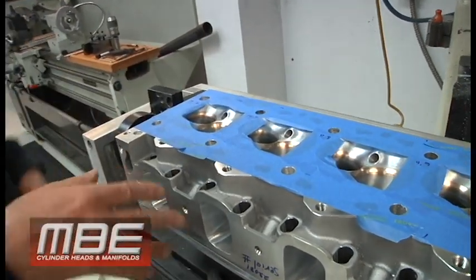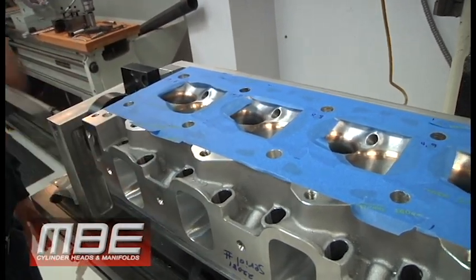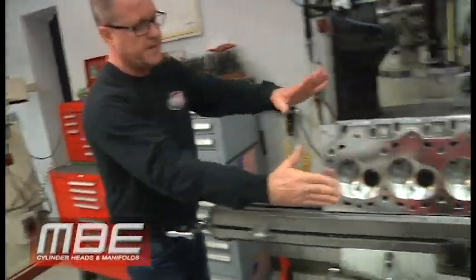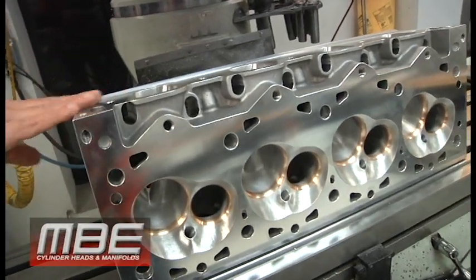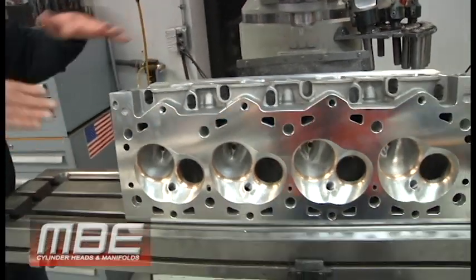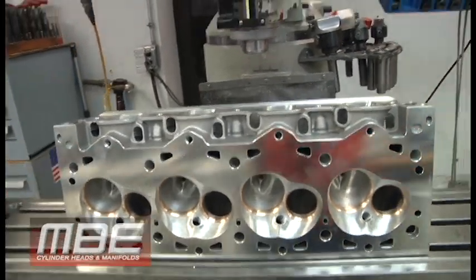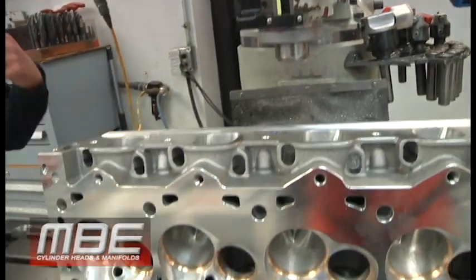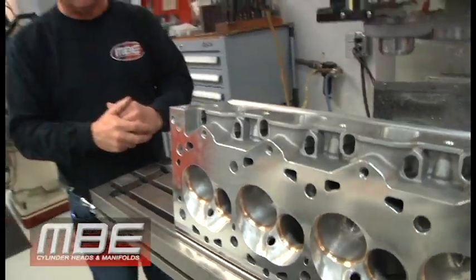Dave Selvig does all of that for us. Then we go to the other machine and correct the intake flange, because now it's at a different angle and the intake manifold won't fit. We take more material off to bring everything back to 90 degrees so everything fits. We do the head rather than the manifold — that way if you change manifolds, you don't have to redo the manifold. Angle milling is a process with a lot of time and labor in it, but we do it all the time.